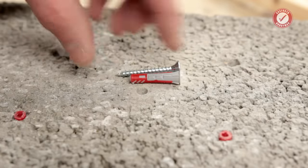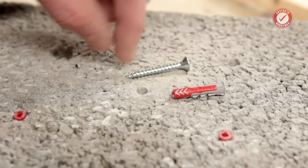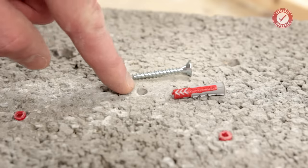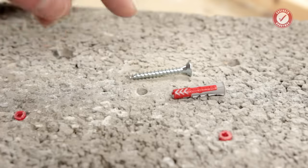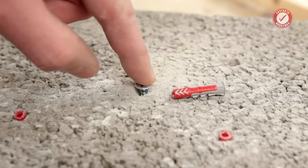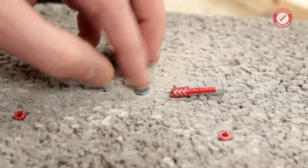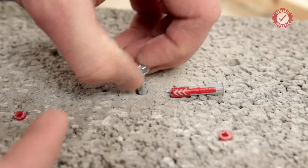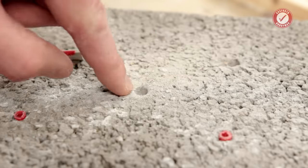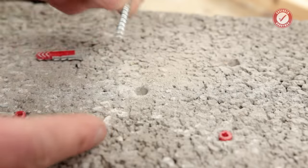The instructions tell you to drill the hole as deep as the screw plus whatever width the screw is — in other words, at the bottom of the hole there should be a gap equivalent to the width of the screw. Personally, I think that gap makes virtually no difference whatsoever. The main thing is that you don't want the screw to be bottoming out in the hole, because if it does, it can start to draw the plug out and it no longer sits properly. So: 6mm masonry bit, hole at least as deep as the screw and then a bit more. Don't lose sleep over how deep you make the hole.